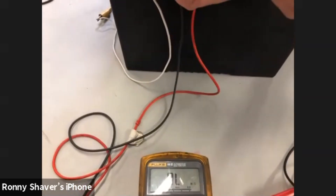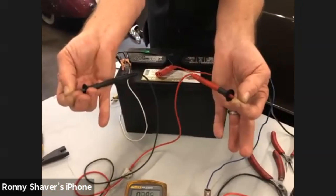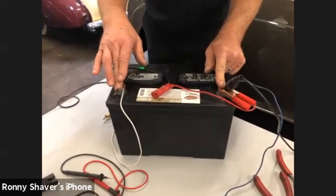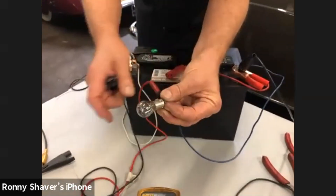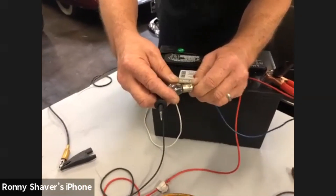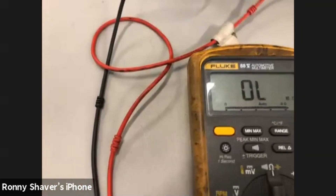On a really sensitive meter you can even get a reading touching it with your fingers. This meter will push very, very low voltage through whatever you're testing just to get a reading — so it's reading through me right now at a very low voltage. I can touch both leads and I'm not getting a shock, but if you're touching a wire and a motor runs, you will get a little jolt. Let's test the resistance of this bulb — one lead to each end. That's one ohm resistance — that's why it's so bright. The higher the resistance, the less current flows, and the dimmer the bulb.